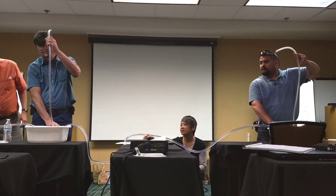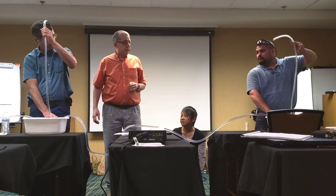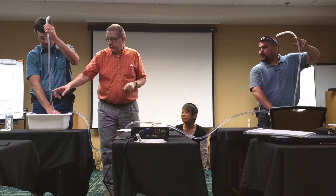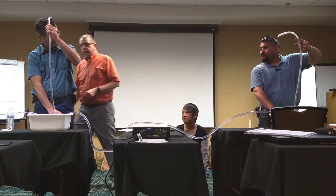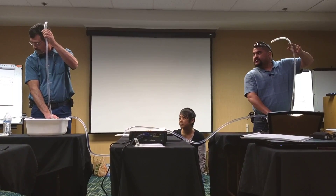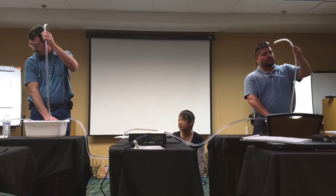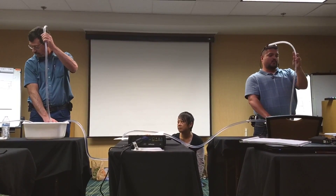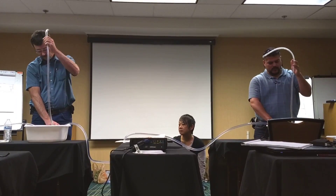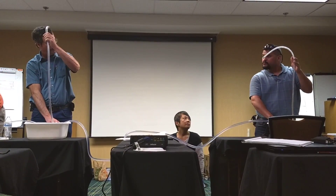And now it goes down. So how do I draw the hydraulic grade line now? Connect the piezometers - it goes from here to there. And then what's the last point? The last point is the nozzle right here. With nozzles you want to be careful because you can have a lot of velocity head, but this one isn't going fast enough to worry about that. So I could just keep opening this and watch this one go down some more, and Jerry's is going to go down a little bit more too.